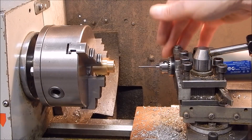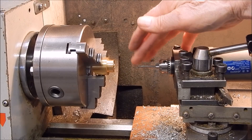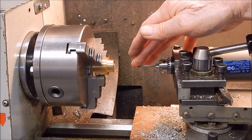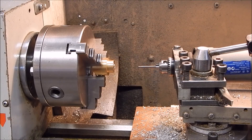I've got the Hilda set up with a 3mm ball-headed burr. I didn't go to a 6mm because that would be a bit too coarse. This is going to be a very fine job — I have to be right on the ball with this. It's going to be hard to judge how far to go in with it, but this is the only way I can see to do it, so we'll give it a go.